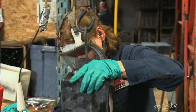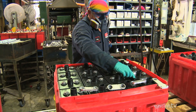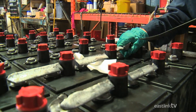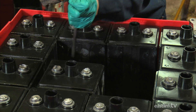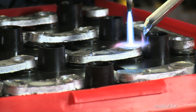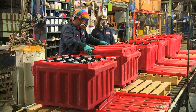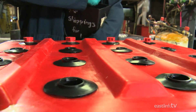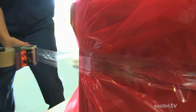This particular battery will contain 18 smaller 2-volt batteries linked by lead connectors to create a 36-volt battery. First, a worker removes the temporary connectors, then places each battery or cell in a larger plastic case. Another worker then attaches and solders connectors in order to make the larger battery. Once the lid has been attached and cleaned, the finished battery is packaged for shipment.